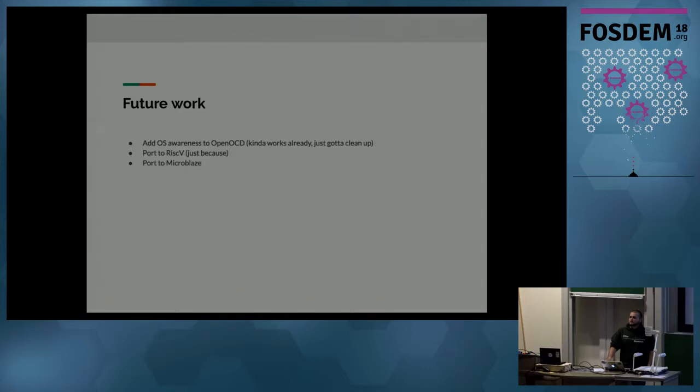A tracer. I haven't looked at it. It's not for safety critical things, right? It's for your laptop, turning power on and off. You could certainly put in hooks that trace events in there. If your project becomes more safety critical, you'd probably want to look for one of the more established RTOSes where you get guarantees about things. It has basic output where it can print events like an interrupt and print timestamps. That's useful when doing board bring up. If a power supply rail doesn't come up, or times out, or takes too long, you get a list of when things happened, but nothing safety critical.